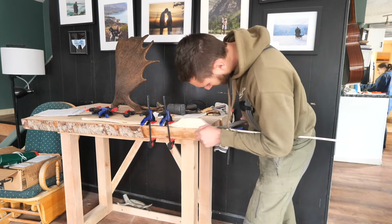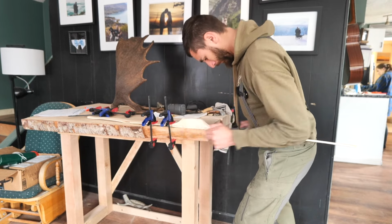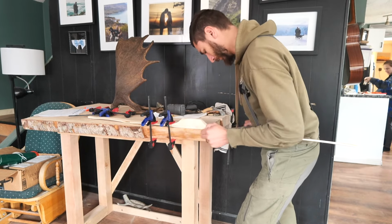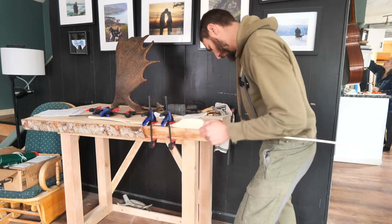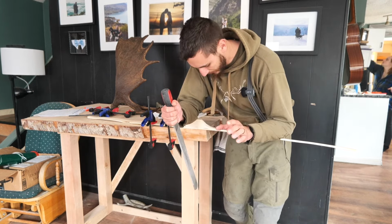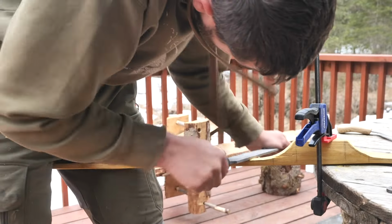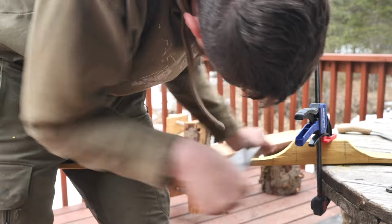As I get closer to the desired thickness of this bow, I'm having to switch tools from a draw knife to a rasp. This gives me a little bit more control. Some woods gum up a rasp, like birch in particular. Hickory and Osage both seem to work good with a rasp, so that doesn't seem to be any sort of issue for either of them.